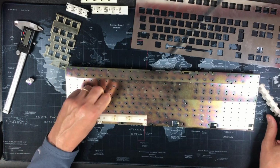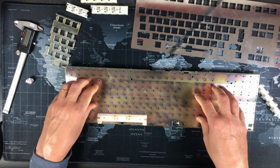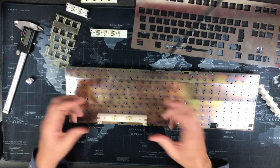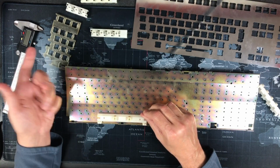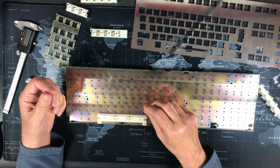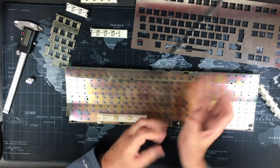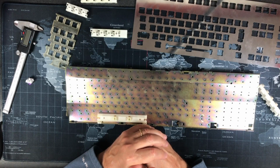So you can imagine it, right? These holes are perfect. I print 3D rows just like this, except with Cherry MX. Put my switches in, put my stems in the keycaps with the mod, and then all that's left after that is wiring underneath and I guess a USB out with a controller in there somewhere.